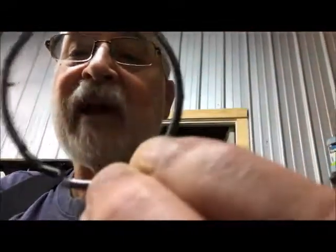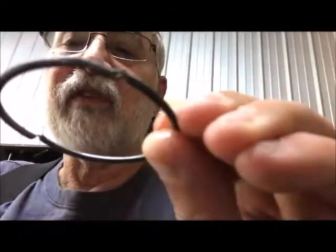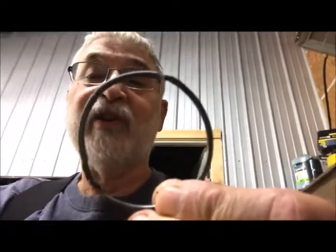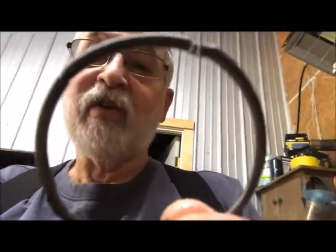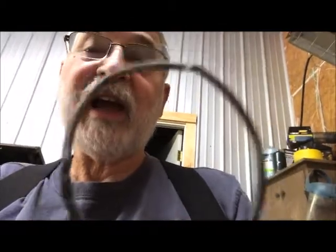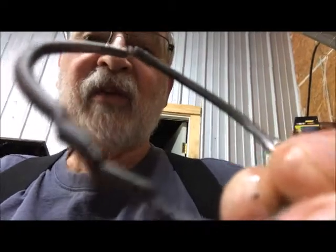So here's what I found back there. I took a pick back there, reached and pulled it out — this is what's left of the innards of an oil seal. That tells me the oil seal is shot, which I already knew, but I also looked hard and the bearing back there looks like it's intact. So we will be going back there and taking the front receiver off, which holds this oil seal, in preparation to replace it, and I'll inspect the bearing while I'm in there.